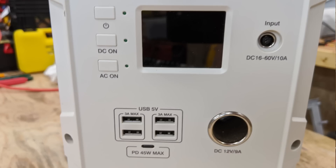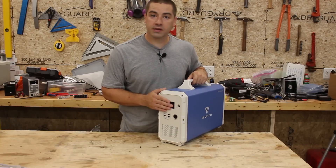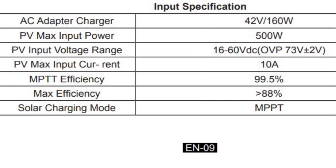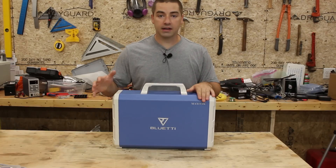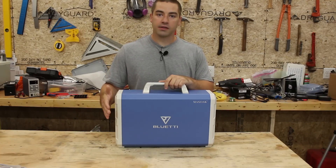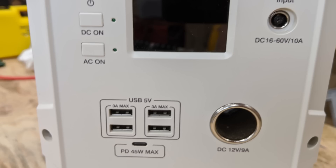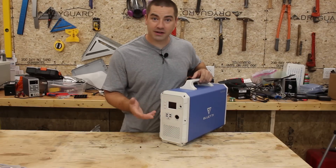On the front of the unit is a barrel plug for the DC input. This is the same input you would use if this was plugged into a wall charger, which comes with it, or the leads with the MC4 connectors plugged into solar panels — they both go into this same one. Now the MPPT charge controller built into this unit can take up to 500 watts of solar panels. I think that's well suited because it means that in one day of sunshine you can fully charge the battery from dead to 100%. I'm actually impressed with how they matched the components: the inverter, the MPPT solar charge controller, and the battery pack. You also have a couple of USB ports and the accessory port.